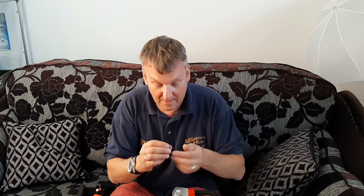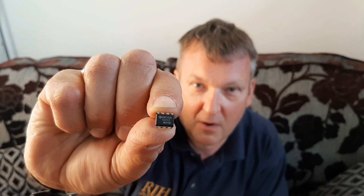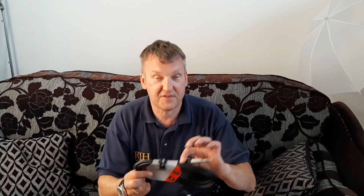In your amplifier, if it's got a balanced input, it has a little device called a differential op-amp. Very posh stuff has a transformer in the same way. But what this does is it looks at the signal and it only wants to amplify a difference. It won't amplify something where the interference is on all three connectors, so it will just ignore that and only let the audio signal through.